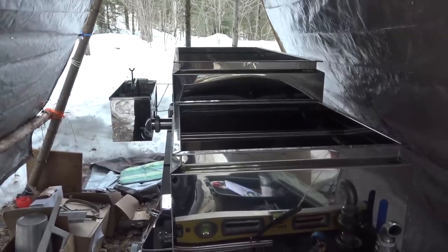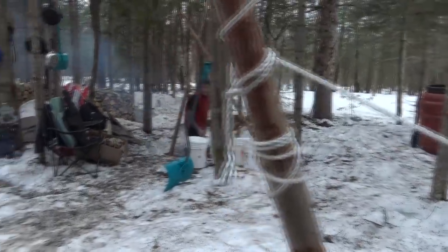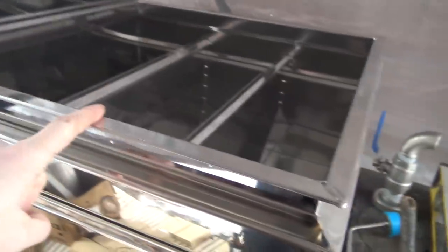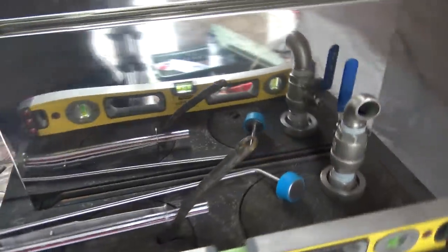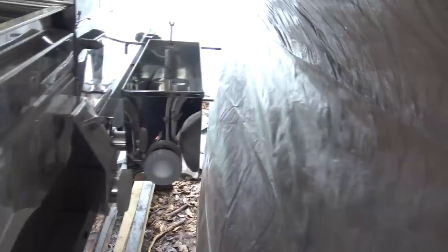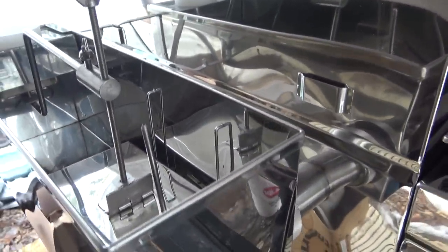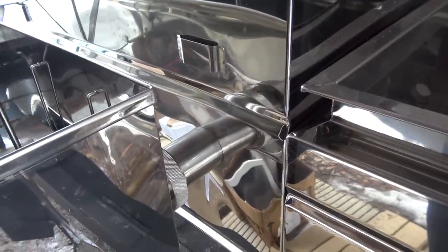This part started to go really quick because Rob came by and helped me lift on the pans. This is the sap pan at the back, the syrup pan at the front, and then there's a cute little cook surface so we can cook some Big Wild food. There's the transfer box — we hook that up. Nothing's level yet, but this is the float box for your inlet. When the sap level gets down too low it can automatically add more sap.